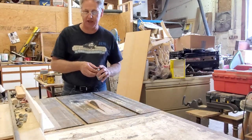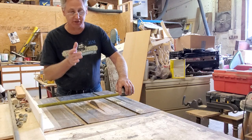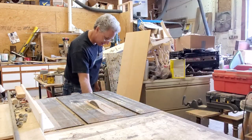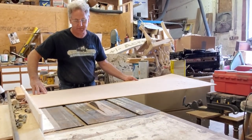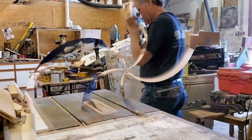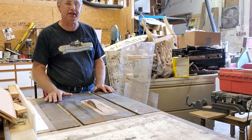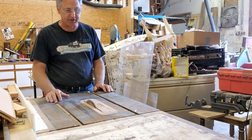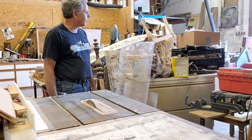Now we're ready to cut the panels. They are 23 and a half inches wide, and we have to compensate for the 13 and a half inches again that we cut the mortises for, so I've set my fence at 13 and a half and we're going to run these panels through. I also have my quarter-inch acrylic sheets set up and ready to cut. Cutting acrylic is dangerous — it can splinter and shatter like glass, sending sharp plastic pieces everywhere. Please wear your safety goggles. Hopefully I can get three pieces cut without them busting.